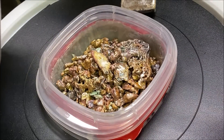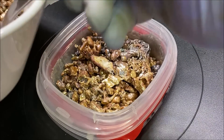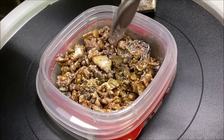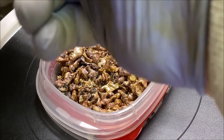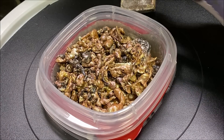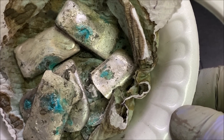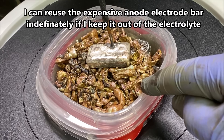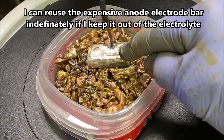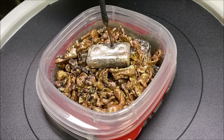I'm going to add the big hunks from our container to the beast anode filter basket because I can fit more in there. I put the big chunks of impure silver in here, then put the anode electrode bar back on. I leave the sacrificial bars off until this silver gets consumed and the level drops and we start coming in contact with the electrolyte — to prevent the anode electrode bar from dissolving. Right now with this impure silver just added, it's far enough out of the electrolyte that we don't have to worry.